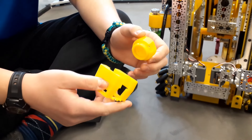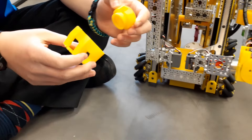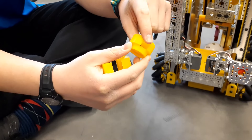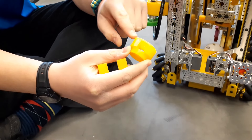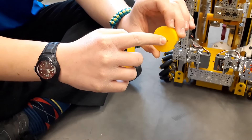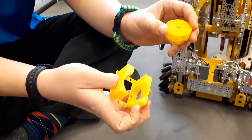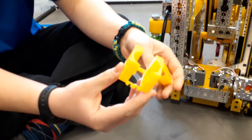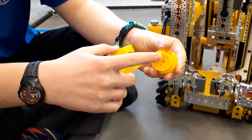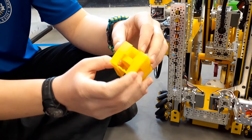This is the actual 3D printed part of the MagSwitch you see right here. As you can tell, there's a slot for the magnets — the three cube magnets that go right inside there. It also has ease of access maintenance on the top, just little holes so you can get an Allen wrench in there. And basically it attaches to a servo, with a gear that goes inside here, and then it goes on top of the servo into its container.